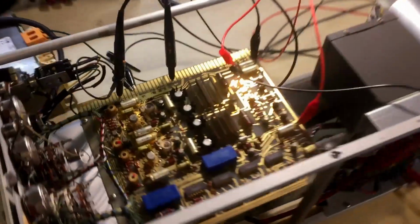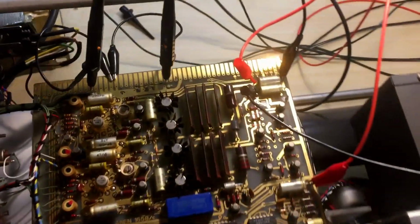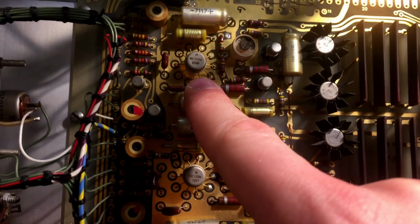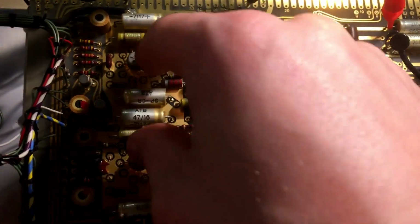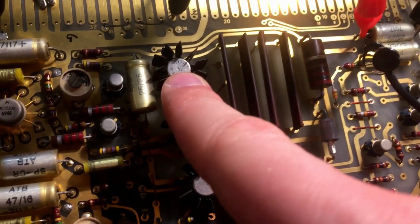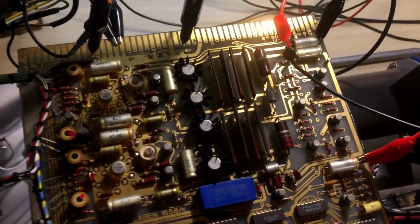This is a little bit of advancement here. So I figured out how to make this thing work. This is the CRT section. I cleaned it up, and now it's actually powered up by a lot of power supplies. Here are the low voltage power supplies for the amplifier board, and they are actually using some Motorola MC1520Gs right there for the operational amplifier for the first stage, and the final stage is using 2N3439s from RCA. Really quite nice board.